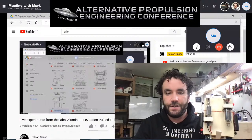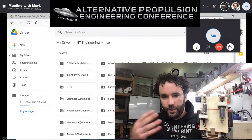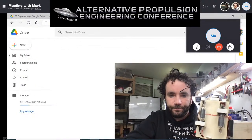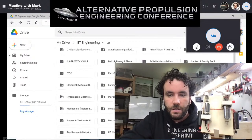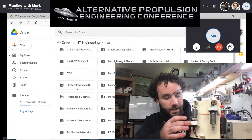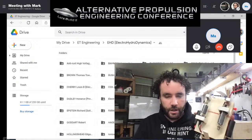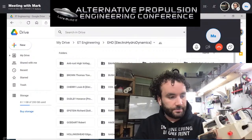The reason we need so much isolation is because it's going to be a sinusoidal wave going between the capacitor and the coil. In order to avoid blowing up our power supply, we need to have some rectification, or isolation, in the circuit. This is a setup that Jeremiah built. It's pretty nice. I'm kind of sad that I'm going to have to modify it. We'll make sure that it will be repairable once these modifications are complete.